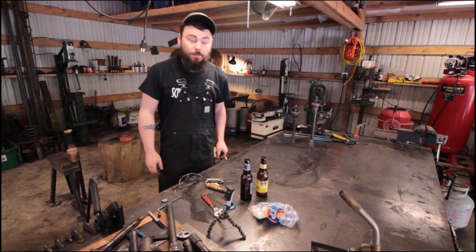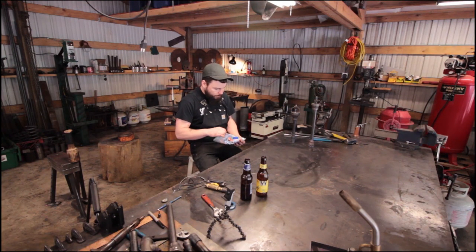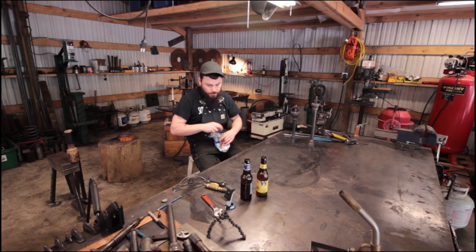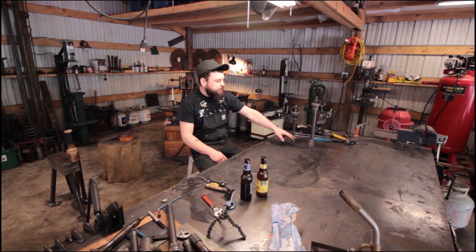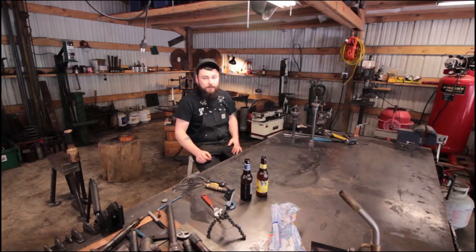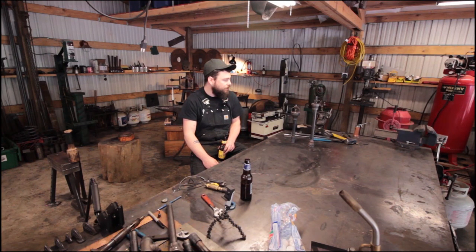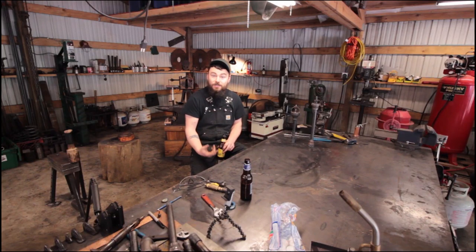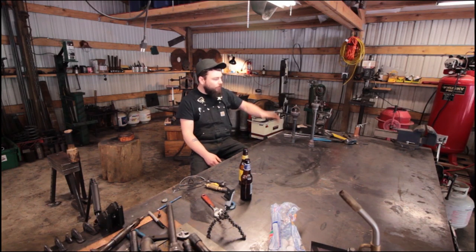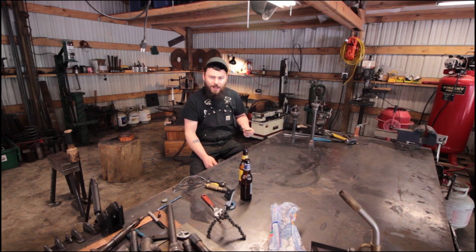Torch done. This is the one I've got running on my forge right now — it has a bigger entry orifice but this quarter-inch build will do just fine. You can also have a smaller flare at the end; you don't necessarily need this big chunky thing. Just screw that on there. Be careful when you're hooking this thing up: make sure all your fittings are terminated properly, you've got enough pipe seal so they won't come loose, and pay attention to the chimney effect so it doesn't bake the sealant out and cause a gas leak — because gas is explosive.